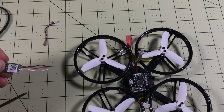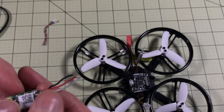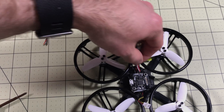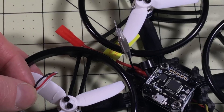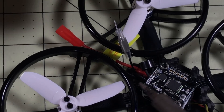I mean, what's the worst that can happen? I got that cable off — it was really easy just to heat up and unsolder. Then I realized there's no reason to put it back on; I actually have an XM with three wires on it ready to go. If you have an XM, you just need three wires — servo leads that I cut off, tin this side, and they'll solder right onto those pads. That's why I don't live stream everything I do — it makes it a lot easier to not look like an idiot.